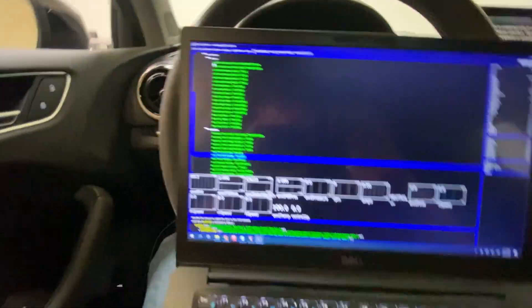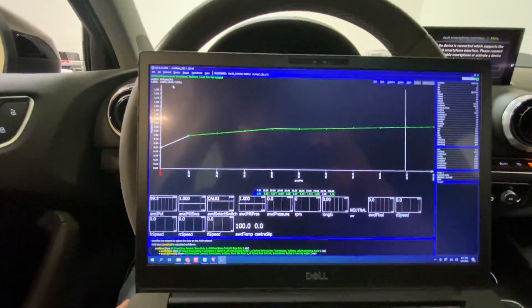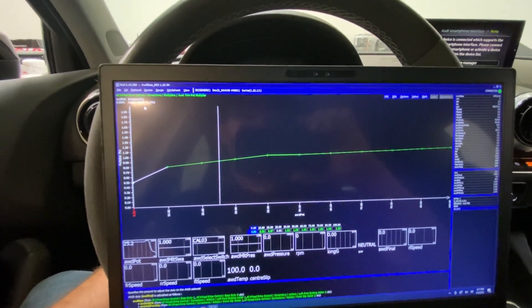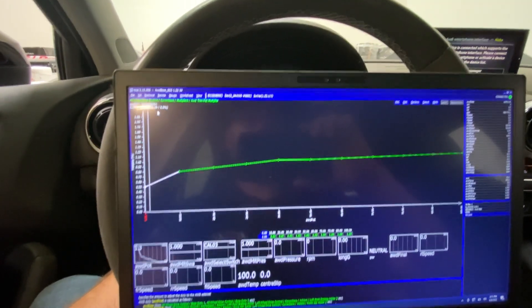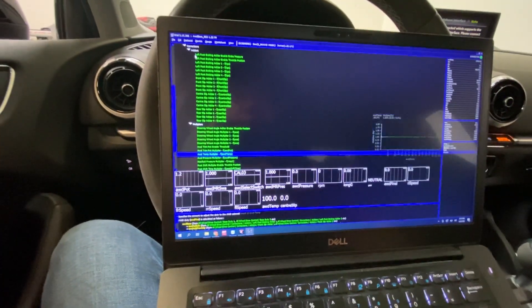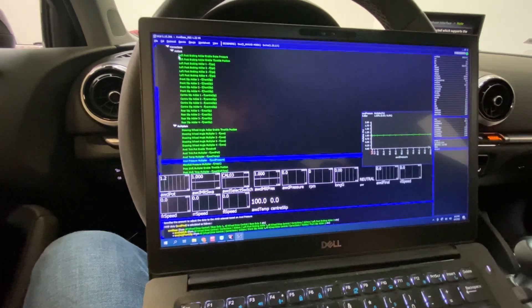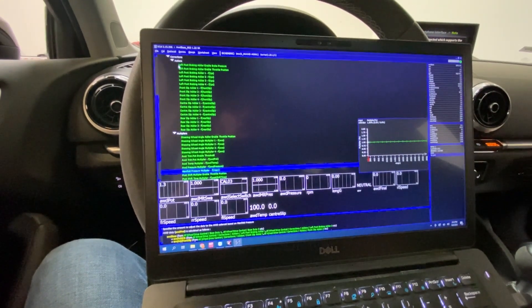This is really important because there are a couple of hardware versions where this gets messed up, so it's always smart to plug in and check. It can feel like it's slipping when you have it cranked all the way clockwise - that could be because the potentiometer is swapped. I've seen that on a few cases. Temp multiplier is irrelevant since these don't actually have temp sensors - only the R8 does.